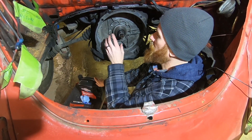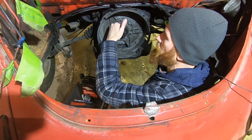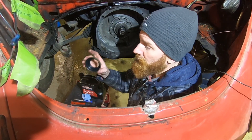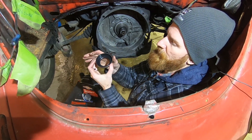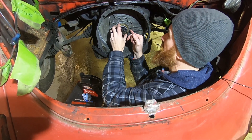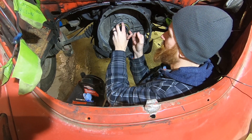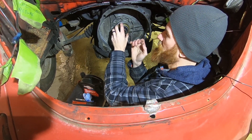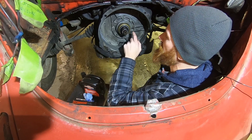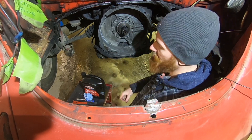Now that our old seal has been removed, you can see the existing hub that it's going to go on. The camera might not be picking up the detail, but there are actually two chamfers on it — one about halfway in the middle, and one at the very back. The new seal has basically a flat edge. You push it on, and they talk about peening it at the back, which means just putting a little dent in it into that chamfer so the seal doesn't work its way loose. The manual says at least three dents, 120 degrees apart. After we put this on, we will do that as well.